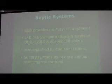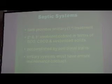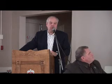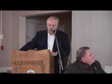There's been a lot of talk recently about pending septic system re-inspection programs. The current program, which is based upon visual inspection of the surface soil, is actually not very well suited to our particular area, which contains sandy soils in Lambton Shores. As a consequence, no program has been initiated by the county, who are actually waiting for a more meaningful program where it can be more invasive, where they can go in and have a look at the septic tank and then look at some of the effluent that is coming out of the weeping bed. That isn't happening in the near future because it would be quite expensive, and they are waiting for external funding. However, re-inspection programs are being initiated in other municipalities in the province.